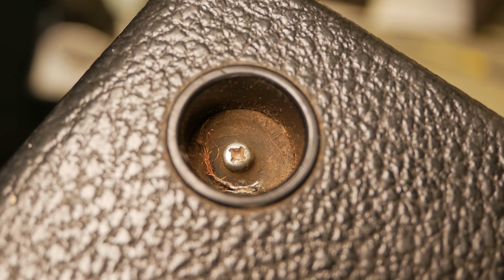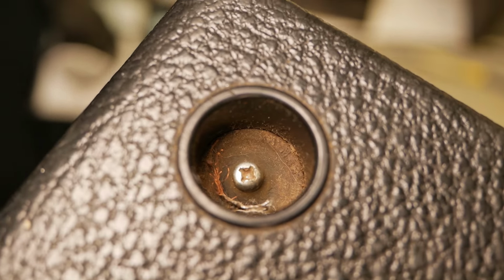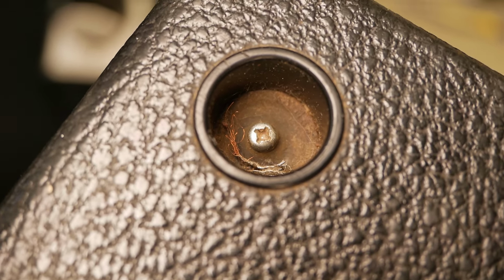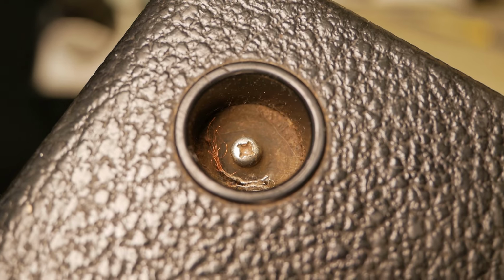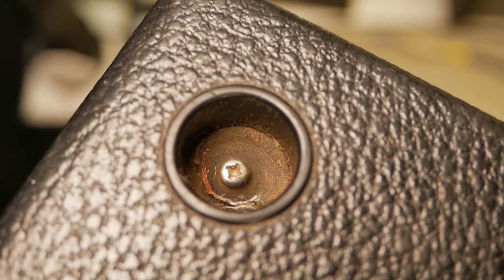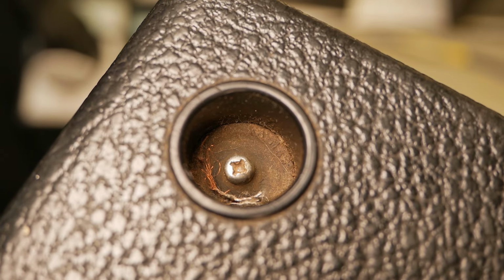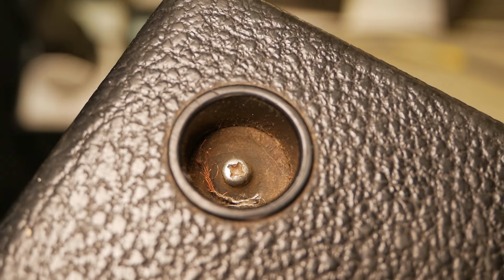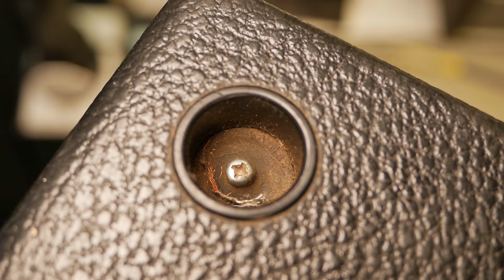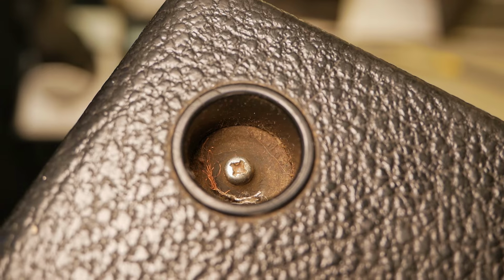It's just like a small imperial screw there, but it's a plastic cup with a rubber disc in the bottom, and the previous techs handily left a little piece of off-cutter wire in there for us. Maybe we can save that for our scrap metal pile. But the idea behind these plugs is they sort of suspension mount the chassis. Now, they kind of work until they don't, and as far as I know, you can't get these parts aftermarket, at least not quickly or reasonably priced. I'm not even sure if they'd supply them to the general public, but yeah, they do eventually screw up as the rubber gets hard and cracks.